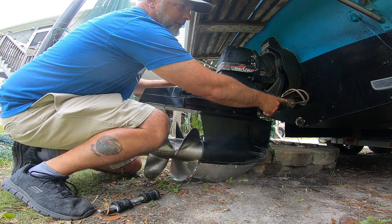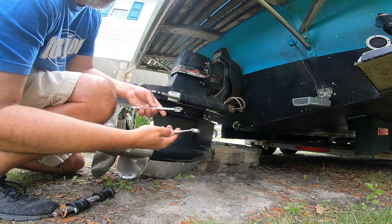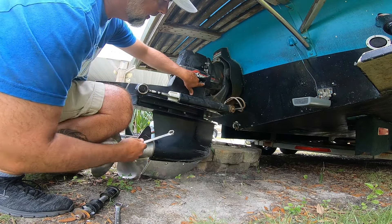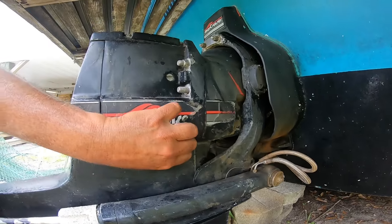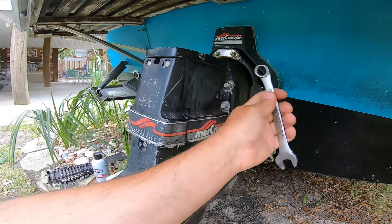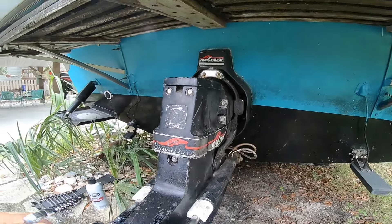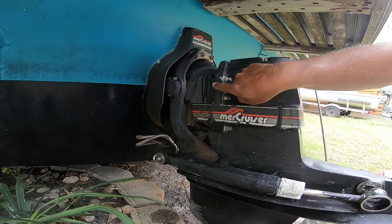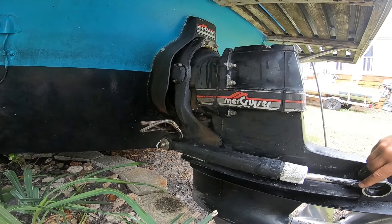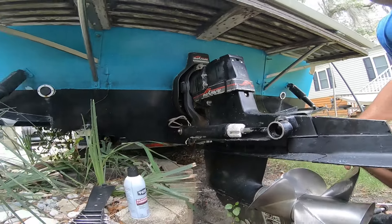Once you get that off, you can take these things and spread them a little bit by loosening these back two nuts right back here. You really don't even have to undo your hydraulic lines. I did all the work so far with a 17 millimeter and a 5/8. There are six nuts that hold this outdrive on - three on that side and three on this side. The 5/8 is fitting them perfectly. I want to remove the middle and the bottom one on both sides first, so we still have some inward pressure. Once we remove those, we're going to slide this outdrive right out. There'll be a shaft, just like a drive shaft in a car, going into the back of the motor on the flywheel with a spline coupler. Once we pull that out of the coupler, we'll be able to determine if this outdrive is locked up or the engine - could be both.